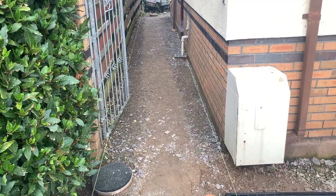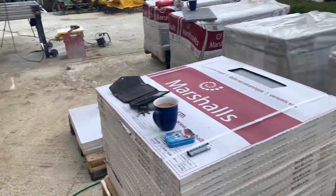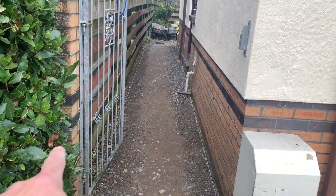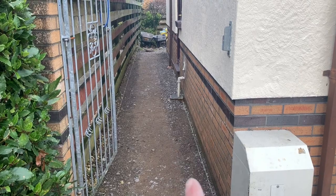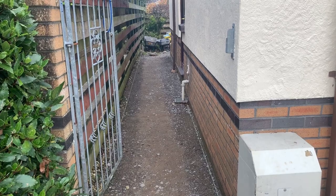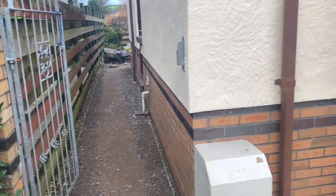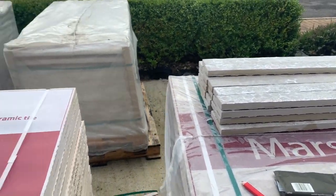Today I'm going to have a go at doing the path, depends if I can cut enough tiles. There's a load of ivory tiles. The width of the actual pathway is 1.2 meters - 1200 mil. So we're going to have a 300 mil border, a 600 mil copper tile in the middle, and another 300 mil border. It's going to be: gray, ivory, copper, ivory, gray. Yeah, so there's a load of ivory ready.